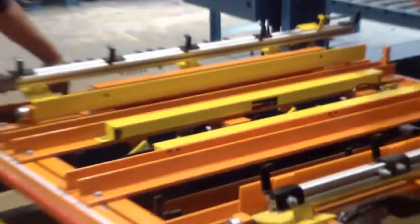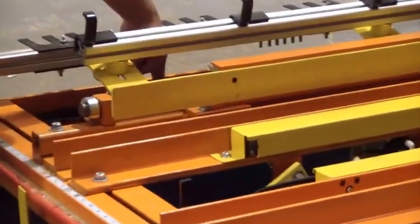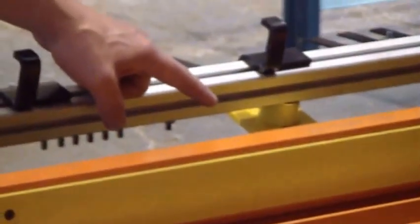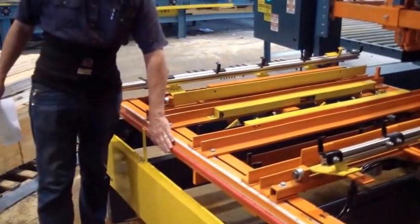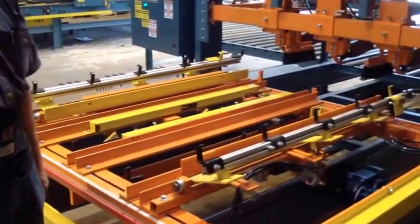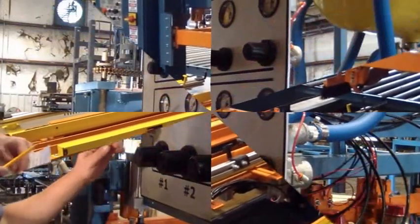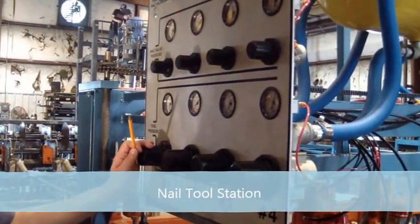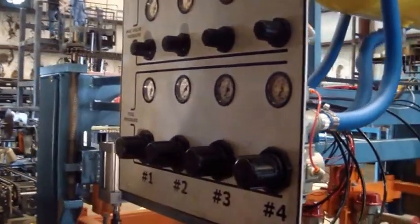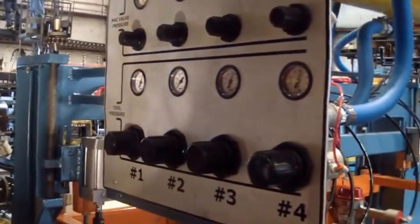That's very important. And they're both wired in series in this connection box right here. 2 things in that connection box, 4 wire connections. The magnetic limit switch number 4 and 5, and 2 wires to your tape switch, your emergency stop. And that's the cart. These are the air regulators for all the tools. Right now there's no air pressure on number 2. We don't have it there because we're making a 3-stringer pallet.